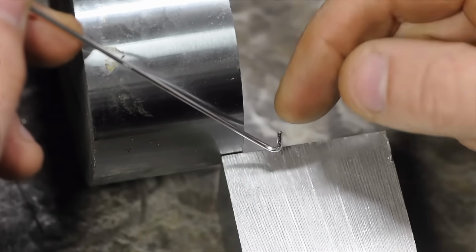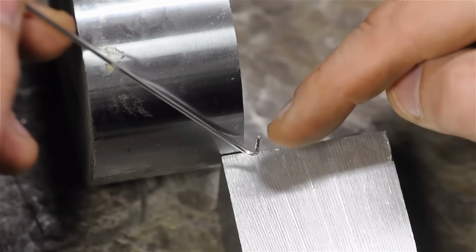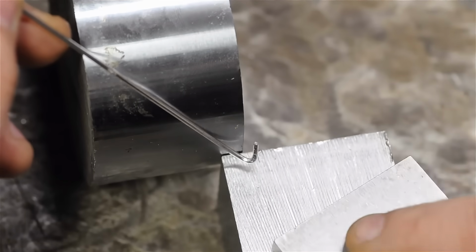Like I said, it depends on how fast the material is coming off and the material properties themselves, of course. There are some materials that are just sort of ductile or stringy. They just don't want to break. They make long, continuous chips. So instead of just depending on that speed and feed and material property, some clever people came up with a geometry to help break that chip.